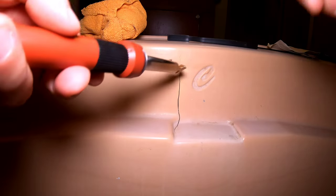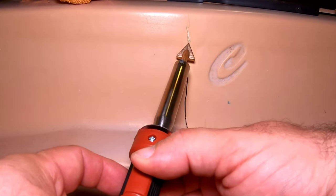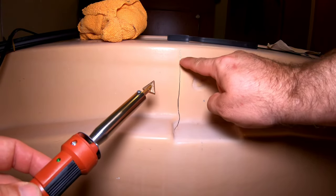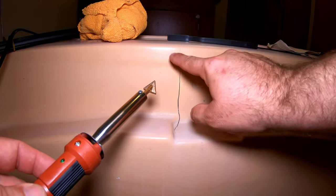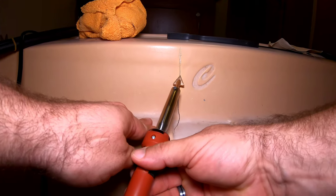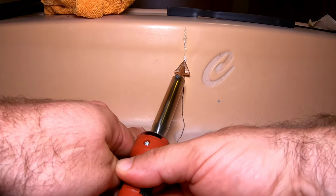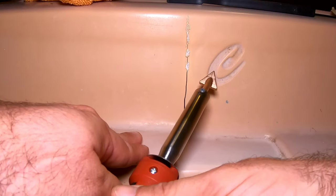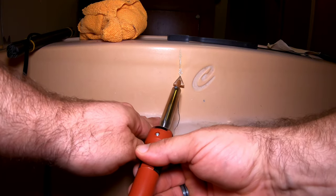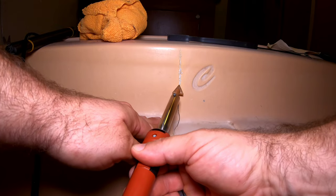What I like to do is just kind of do test shots. She's getting hot enough that we can use the properties of it. See how I just tinned it closed — I mean it's not cracked there anymore. I just tinned it closed with the very tip. You want to stitch it like that at its worst spots. See how I'm just stitching it? I'm using its own material, which is going to adhere to itself best. Now it's not going to be fully hardened, so you don't want to apply too much pressure. We're just going to tend this to close the gap, which technically will make it waterproof.